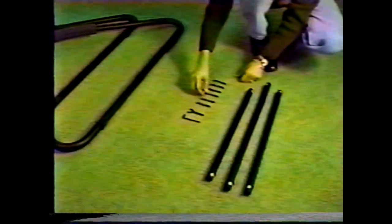Now that you have completed step number one, put the finished frame to the side and begin to assemble the armrest frame. For this step, you will need two armrests, three straight support bars, six long bolts, and the Allen wrench. Match the letters on the ends of the straight bars to the letters on each armrest. Begin attaching the straight bars to one armrest using the long bolts. Beginning with the parts labeled A, twist the screw in by hand, then tighten with the Allen wrench provided. Complete one side, then flip the armrest over to complete the other side. Attach the other armrest to the straight bars using the remaining three long bolts.